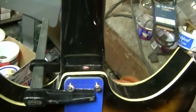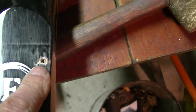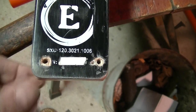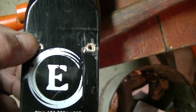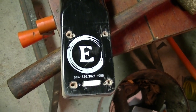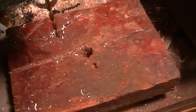I started the screws just a tad and then I'm going to drill some pilot holes — this is to line them up. Here you can see the impressions the screws made, really close to the old holes. One over here didn't even get started. What I'm going to do — and I was going to wait on this but now I've got to do it — is put dowels into these old holes, glue them up, and sand it down nice and flat, which will make these screws go in a lot sturdier. And since I've got to do that, I'm also going to glue up the top split and clamp that.